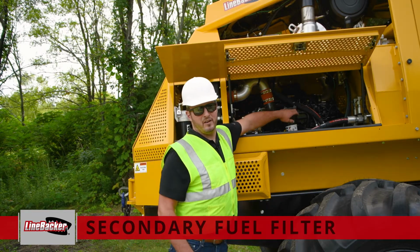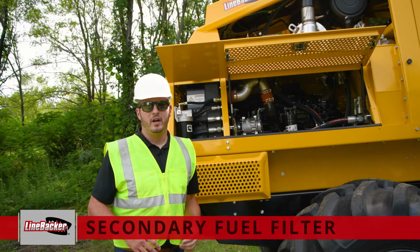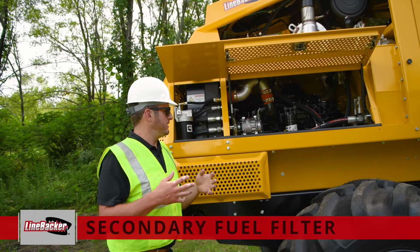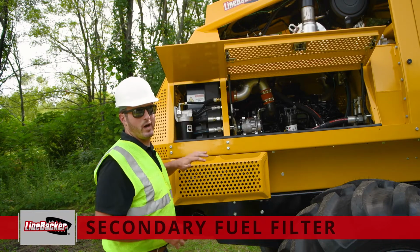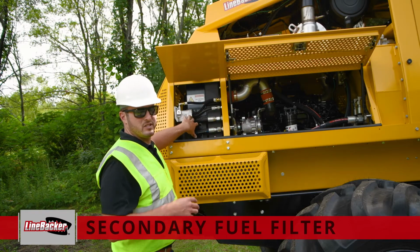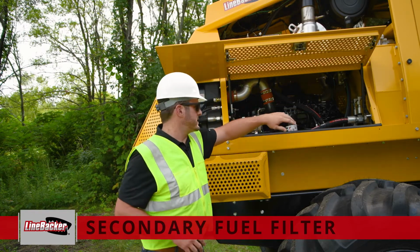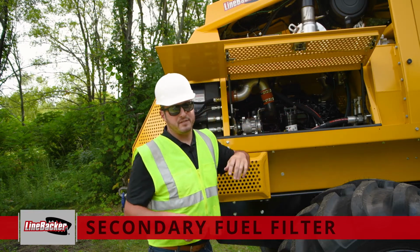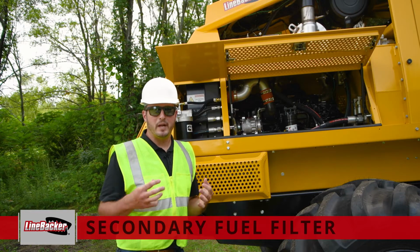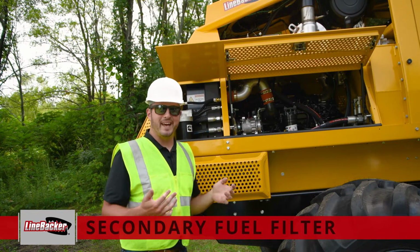The second line of defense in the fuel system is this secondary fuel filter. That filter is a bit tighter than this fuel water separator here. So this kind of catches the larger debris in the fuel, and this will catch that finer debris. Now this is actually a filter that has a very small micron rating. It actually picks up debris smaller than a red blood cell. So that's cleaning just about everything out of that diesel fuel.